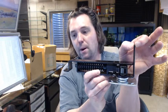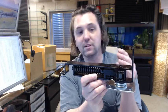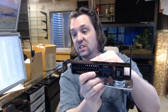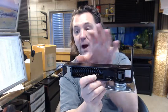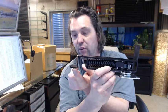5/16 thick preparation for this. Okay, and then from there, you can draw out the rest of your dimensions. 8 3/8 over, 8 3/8 over, 1 7/16 from the bottom of the door will give you all this body. Then you're going to have to mortise for this little tongue over here, 5/32 by 13/16 wide.